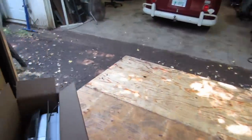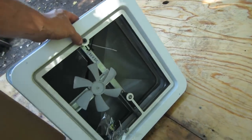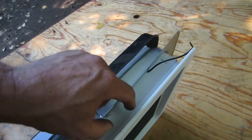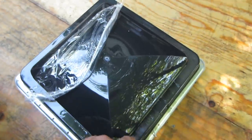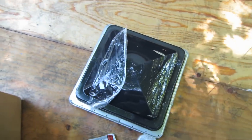Bringing the new skylight out to the light. It has a bottom frame that should be held on by one or two screws. Found it — I'll remove that and prep the flange with the sealer that came with it. It comes on a roll — probably the same type of stuff — and I'm going to put that on the frame down here where I have easier space to work. It also appears to come with new screws that have the same square head drive as the originals. Once we've got all that done, we'll get back up on the roof.